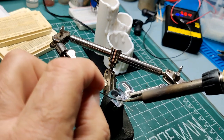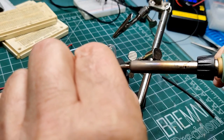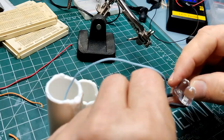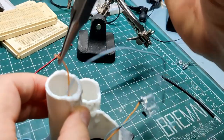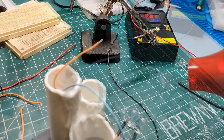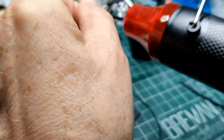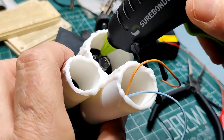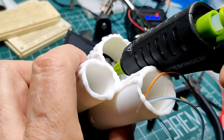I'm using 12 volts to drive this light, so I can wire four LEDs in series without an issue. I'll use some hot glue to mount the LEDs somewhere in the middle of each candle section. Lastly, I used some antique wax paint to add aging and weathering to the candles.